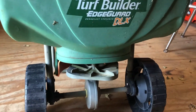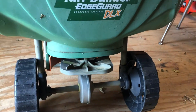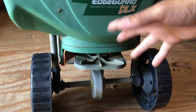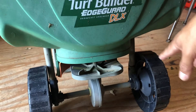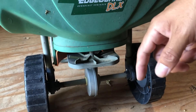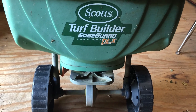As you can see, luckily this was an easy fix. I do want to acknowledge that I'm doing this video because I saw many other videos making reference to a part in the internals. I didn't make it that far — I really wasn't looking forward to doing that. They reference calling Scotts and telling them about the problem, and some people say they had to pay for the part while others said it was mailed to them directly. I don't believe that was my issue. My issue was over here with this little axle corroding. So for that person who may not want to mess with that, it may be something as simple as putting these bolts on each end. I hope this really helped you out and saved you some money. If you like this, don't forget to give it a like, be sure to subscribe, and thanks so much for watching.